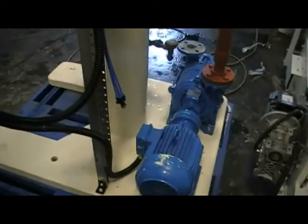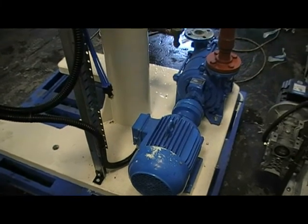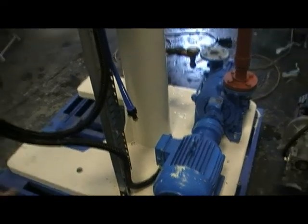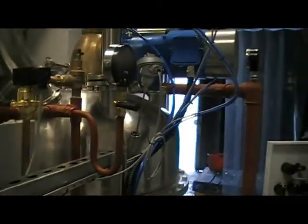Here's the vacuum pump and the vacuum motor. We've mounted them locally onto the PLC for testing purposes. But of course, if you're going to site the pump some distance away, we can provide a longer cable, pre-numbered, so that it will only need to be wired into the control panel, putting the numbers to the terminals, which we can provide photographs for when you come to install it.